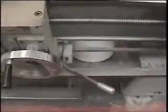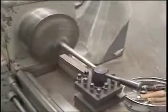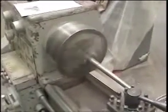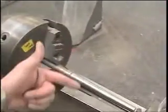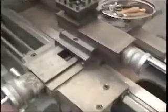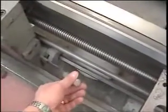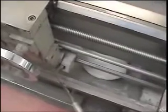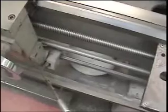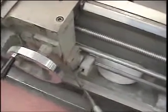As you've learned, this lever, when lifted, turns the lathe on. You can see the chuck is spinning now. You need to make sure it goes in the right direction — it needs to rotate in the forward direction, which is over the top. By pushing the handle down, you will put it in reverse, and we don't want that to happen. To stop it, return it back to the middle position. Do not push it too far, because pushing it to the bottom will cause the machine to go into reverse, which creates mechanical problems and can damage the machine.